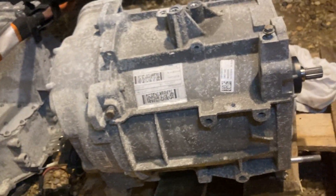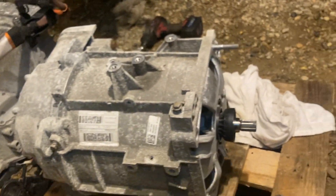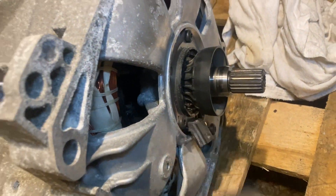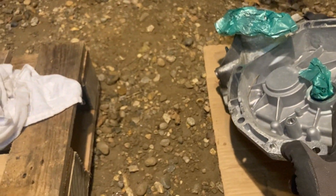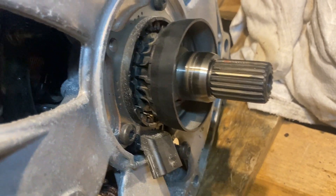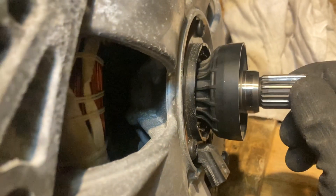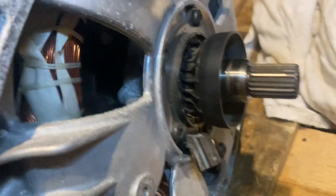I think we can rebuild this. One of the biggest issues is movement with this shaft. Now it's all apart I can steady it and give that shaft a good wobble — we're trying to find out if there's any sideways or up-and-down movement, because that causes issues with that sensor. It looks okay. As well as that, the seal area — I've put a bag over it to keep the dust out — where that seal goes, there is a little bit of corrosion, but it's not affecting the seal. This isn't discoloured or worn particularly, and the tapered splines look okay to me.